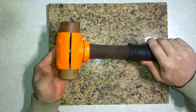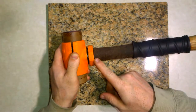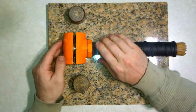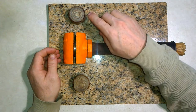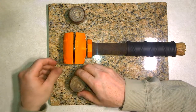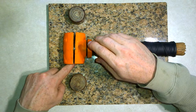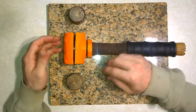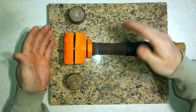Which is the really cool thing about this mallet — it breaks apart. You just turn this bottom nut and the heads come right out just like that. This allows you to prolong the usefulness of a head by flipping it around. As you can see, the inserted ends of my heads have seen some use. I can keep flipping a head as either face gets worn, and while using the fresher face, the sleeve the other face is inserted into actually sees some restoration to its shape from being impacted.